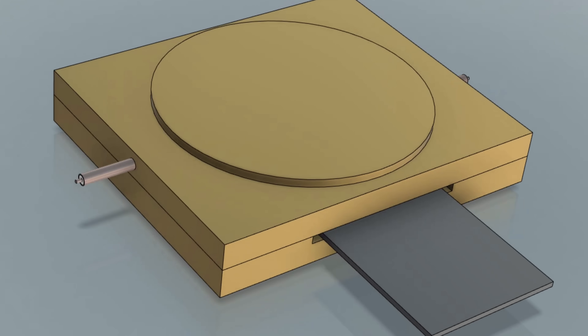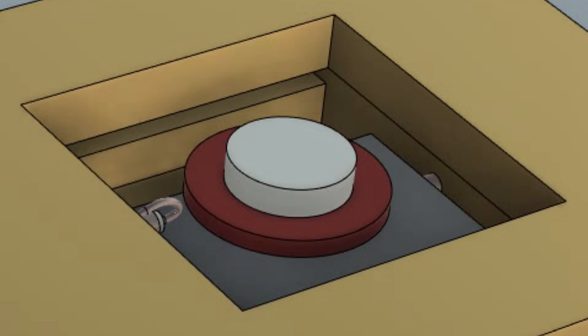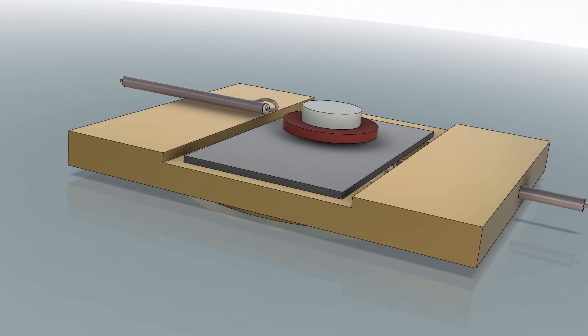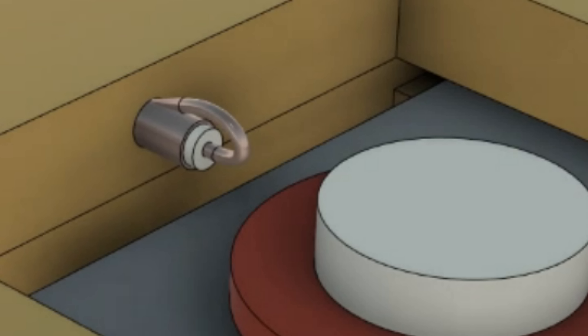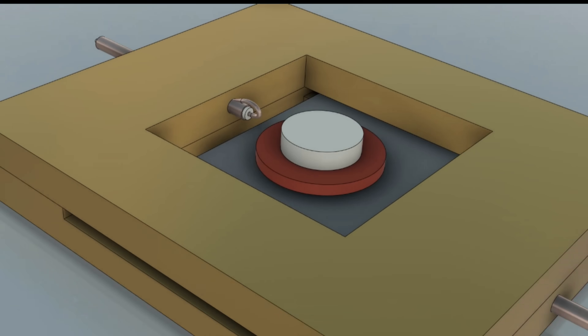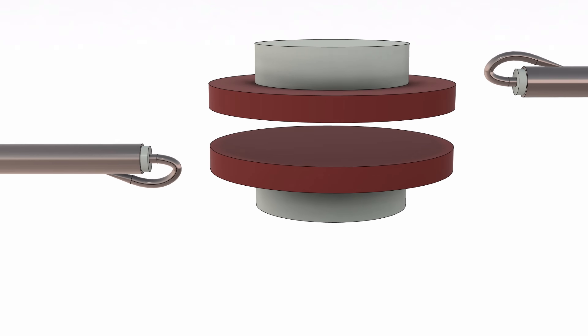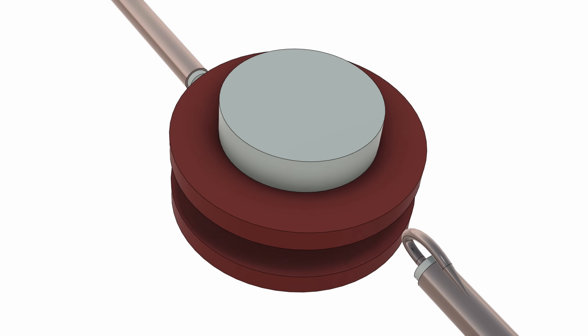Time for a quick sidebar moment here. A split post dielectric resonator uses two ceramic pucks supported a fixed distance apart inside a microwave cavity. RF energy is injected using a small loop fed with a coax line. A second identical loop samples the field within the cavity.